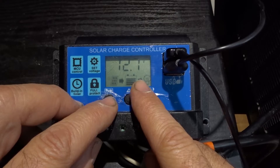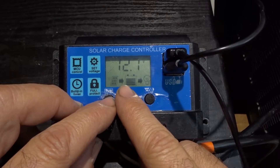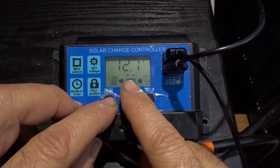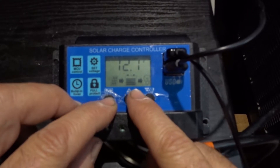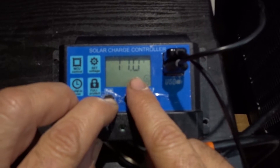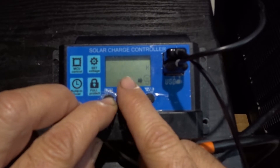My unit has been on all morning, going from 12.2 to 12.1 to 12.7 volts. I'm doing a test to see if my shop light used as a grow light will drain my battery. Right now it's charging even though the sun is overcast. You could change the stock 10.7 drop-off to 11.0 or higher. This is the 24-hour mode — it has a built-in photo cell that reads off the solar panel.